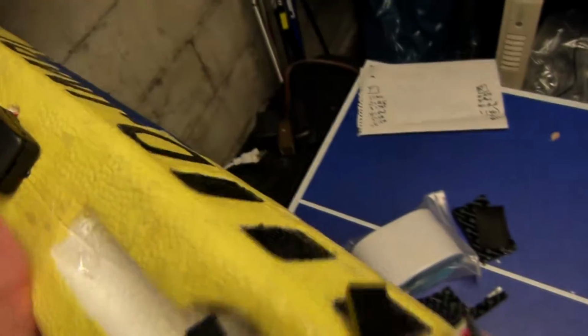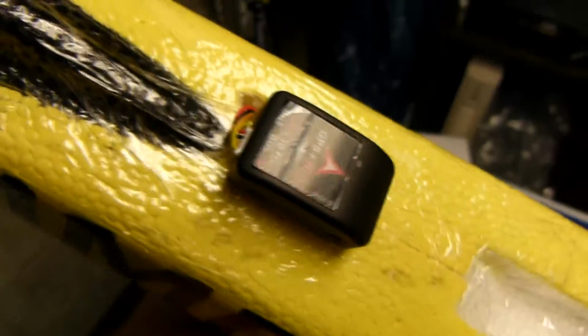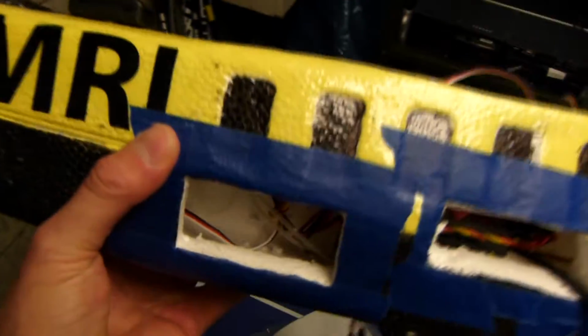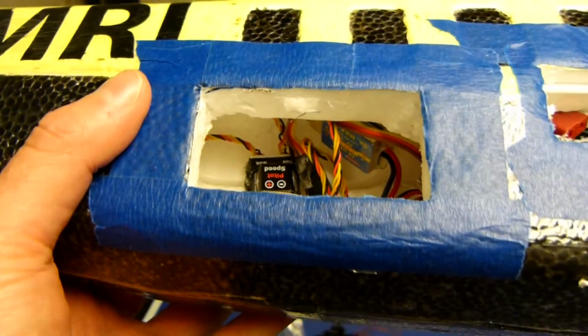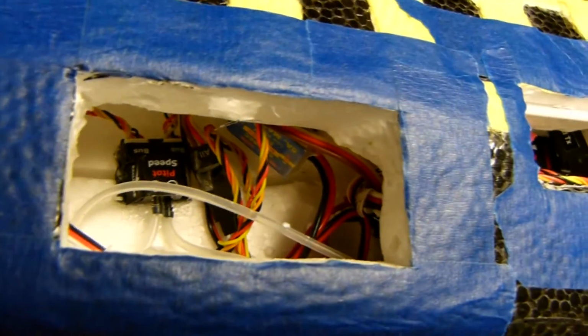Okay, let's take a look at what we got so far. So far I have the GPS module CA'd here on the back, wire running through there. And I've had to change position here. The PITOT, the airspeed sensor, is now located here rather than back here. It was in this compartment before, but now I moved it forward because the tubes would not quite reach.